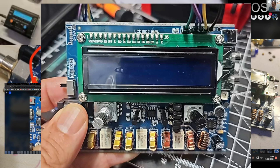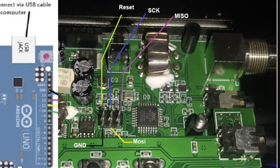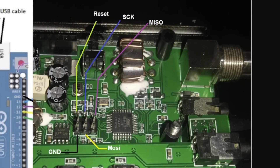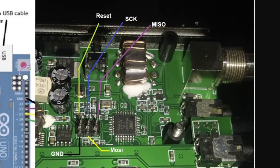They haven't told me if I use these pins marked here on the board, but I assume these will be the ones for using the IDE software. I've got my Arduino UNO board and you can see the configuration — it starts at number 10 and ground, and ground ends there as the last one. So you've got green, yellow, purple, blue, and black, which are marked in this photograph. MOSI is yellow, MISO is purple, SCK is blue, reset is green, and ground is black.